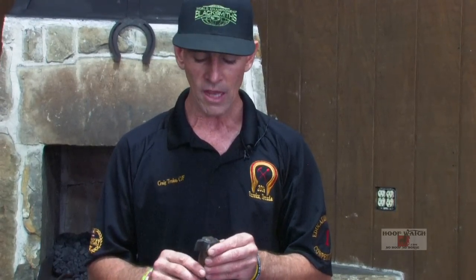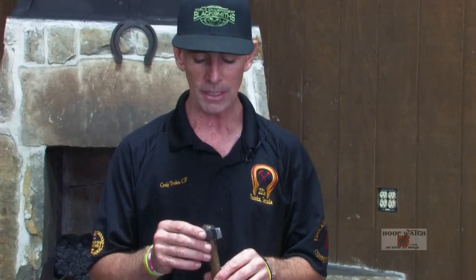it's a fun class. This is probably one of the more fun classes. It brings people outside their comfort zone. We need to make a fuller. We're using A36. It's cold rolled steel. It's 1 inch. We're giving you 18 inches of stock so you can hold on to it with your hand. You might use a glove, but you have to drift an eye in there.